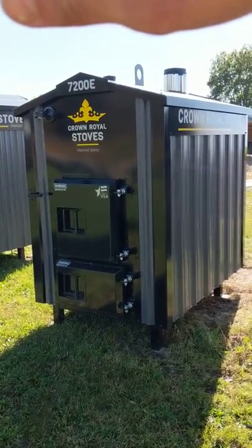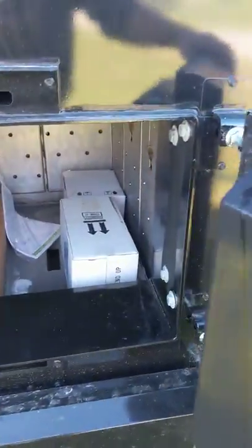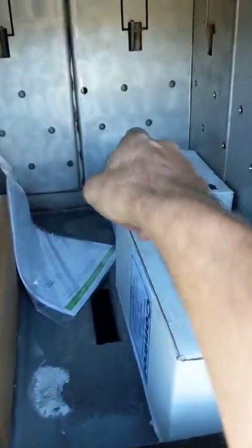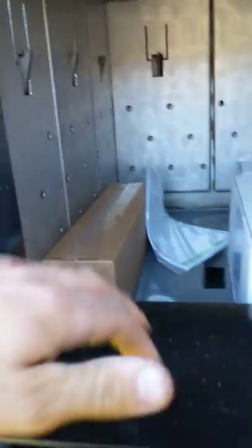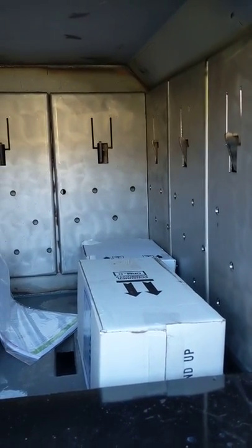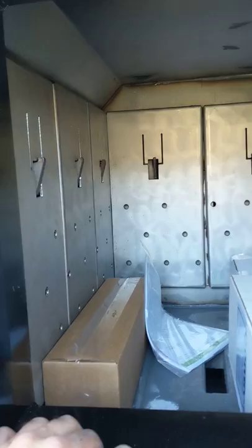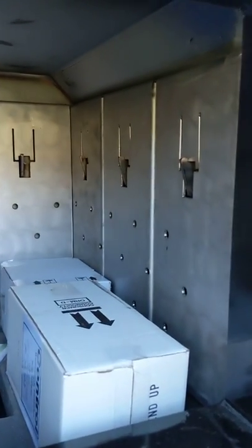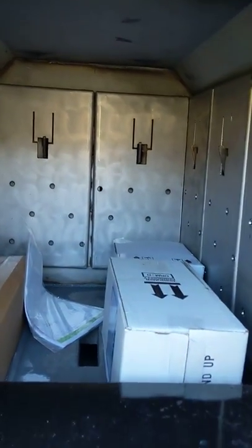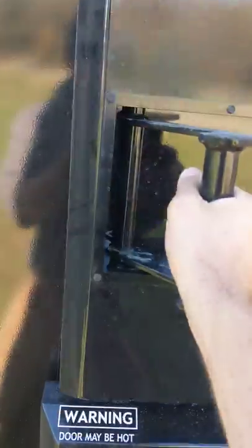Good shot of the front — nice loading doors, top and bottom. Now, this is our smallest stove. This is what comes included with every model: you got a gallon of chemical, your float valve and a light, all your paperwork there. You can see the nice 10-gauge panels. Really really like this stove a lot. It's a great little ripper of a stove. Good look at that — got a bended firebox on top, minimum welds, nice nozzle, thick concrete refractory.